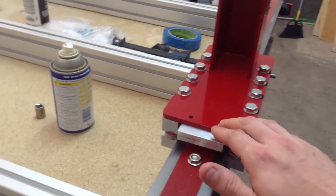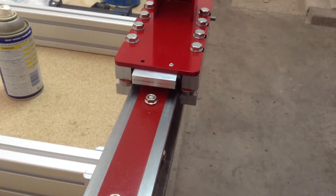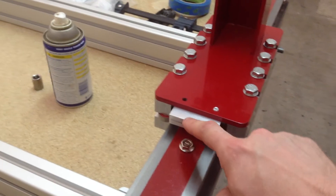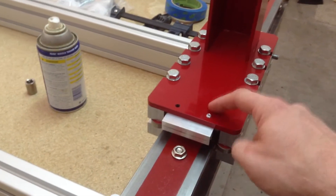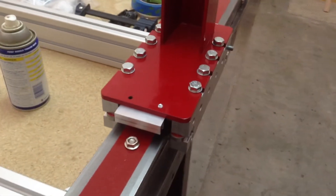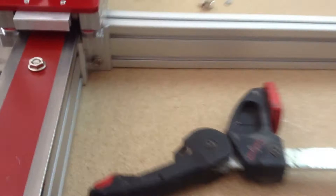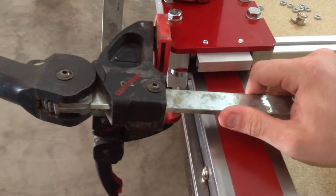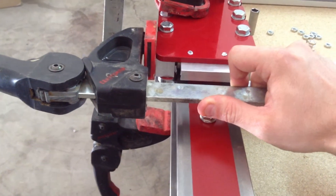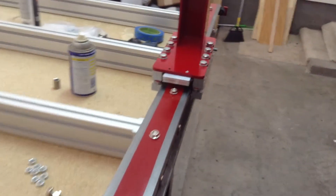What I really want to get across is some of the ways to square this up and talk about some pro gear stuff. Once the carriages are on and I've got the gantry riser on there, please — please, please — mount your brush holders before you mount this gantry riser to your bearings, because you cannot get to those bolts, which are about 7/16ths bolts that hold it underneath there. For squaring this up, here is nice and flush and there is nice and flush. I got two soft-face clamps — real light force, you don't need a lot. Get this thing half on the tip of the gantry riser and half on the block of the linear carriage. Cinch the front together, cinch the back together, put the bolts on. It is probably one of the easier operations you'll do in the build of the machine.